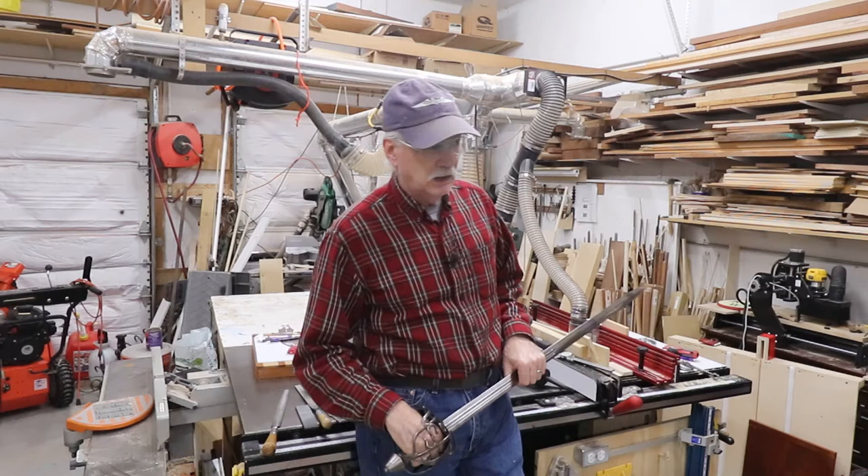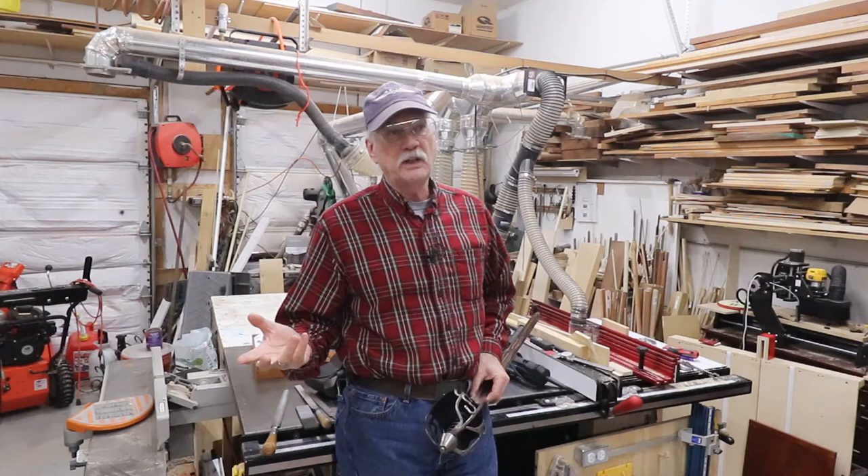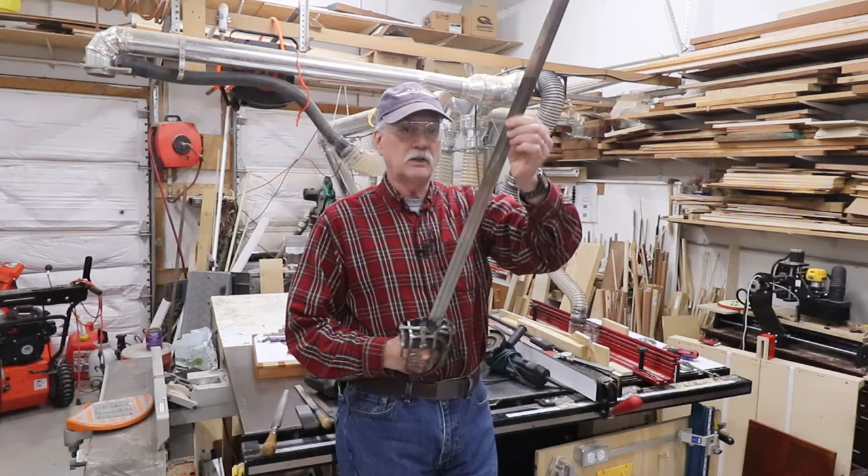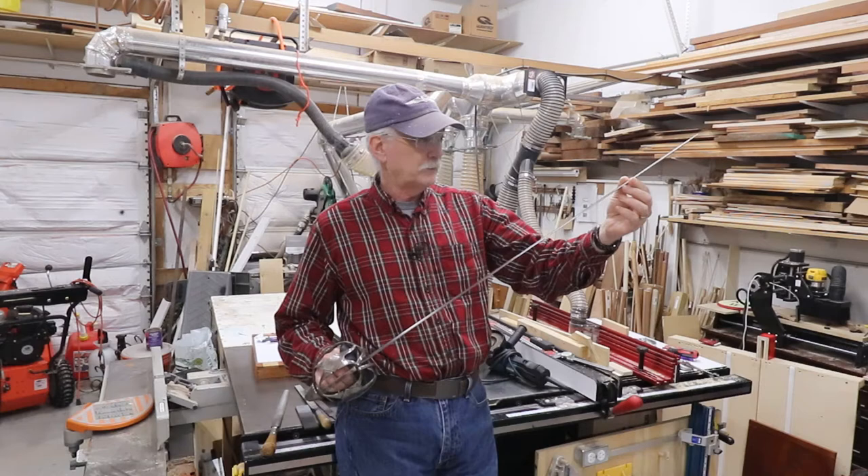It's a little heavy. You wouldn't see a single-handed sword through most of history that was more than two and a half pounds, especially during this period — even from the Bronze Age on up. So this weighs about three pounds. I have to take some weight off of here. It's a little thick up here at the fore part of the sword. It's okay by the fuller. I'll take some metal off the sides here. You'll notice I'm handling this like this because there's no edge.